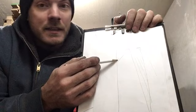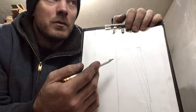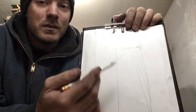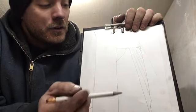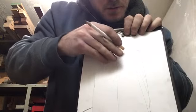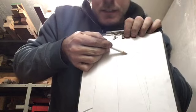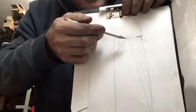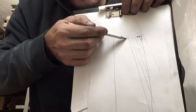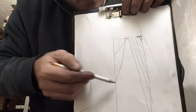So you break the 90, you take that off, you do that on both sides, and then if you want, you can move on to a fresher belt or a brand new belt or whatever you want to use. But then your next step is here. Not quite the exact same point. You come in a little bit and you take off something like that.